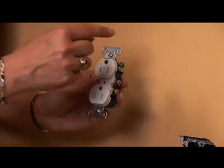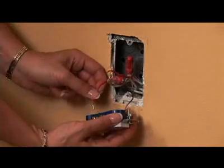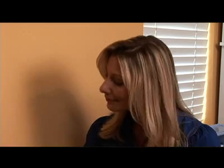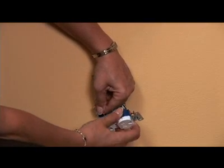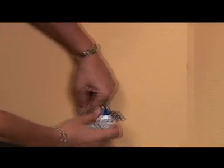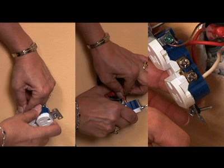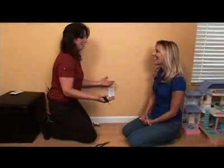We're ready to install. Take the ground wire and screw that around the green ground screw. The next thing is to push the wires into place — it's very simple, just pushing it in, and you'll hear it and feel it click. The next thing is to install the hot wire, and it's easy as just pushing it into the hole on the back, and the second one, same thing. Then lastly, we'll put the white wire in, which goes to the silver colored. All we've got to do now is push everything back into the box, and then we mount the wall plate. We'll need to turn on the circuit breaker, and our installation's complete.